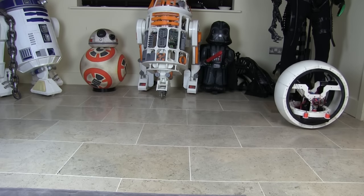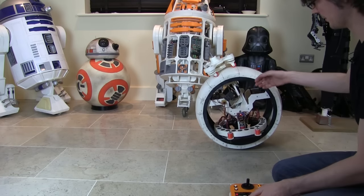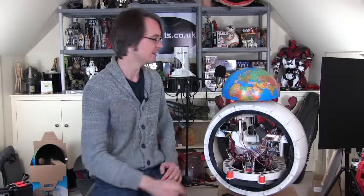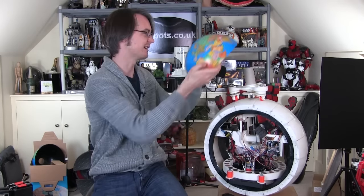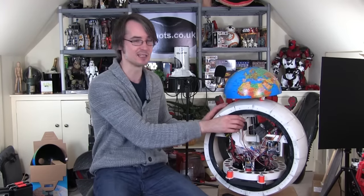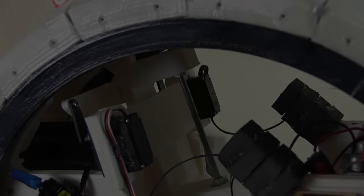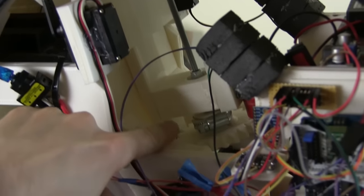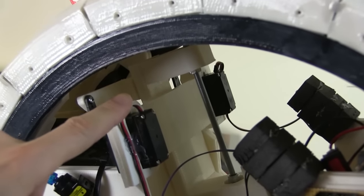In part three I went ahead and built the head stick to actually move this head backwards and forwards. That's got another inertial measurement unit on it, so that when the head tilts in one direction it still maintains centre of gravity by subtracting a little bit from the internal hub. So I built this mechanism that slides backwards and forwards, and I had a look at this globe — or at least half a globe — which is exactly the right size for the head.